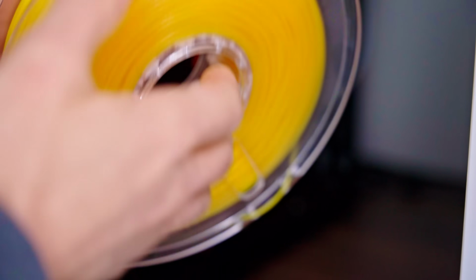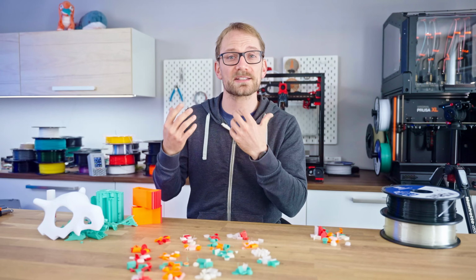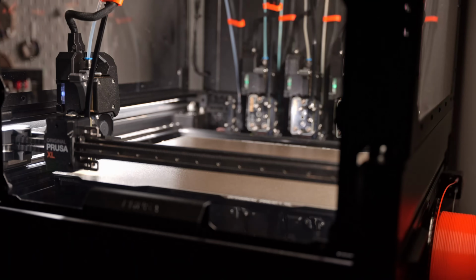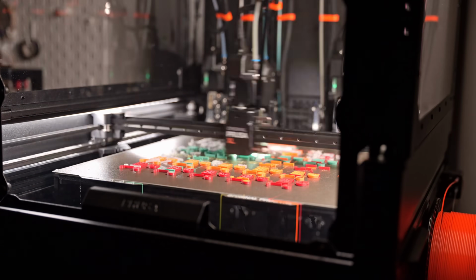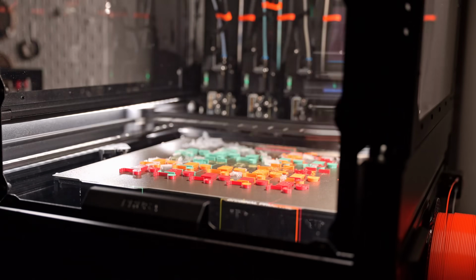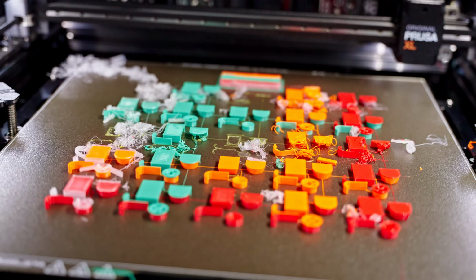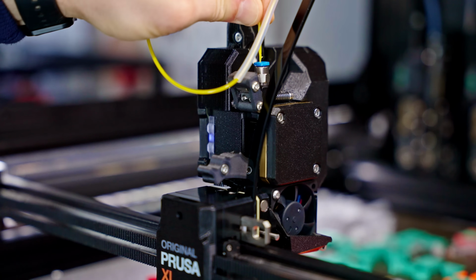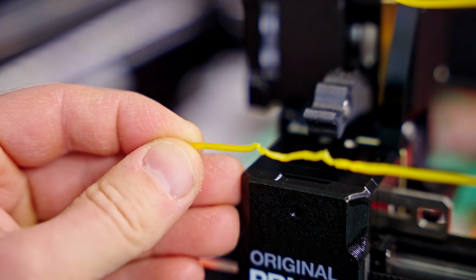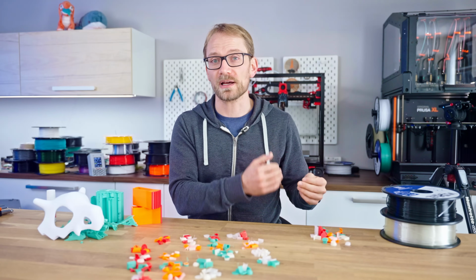Flexible materials have a lot more variance in what exact material they are, so I expected there to be an interesting difference in how well they would bond to other materials, too. But the problem is that the Polyflex filament itself has a much grippier surface than the Fiberflex, and it immediately jammed in the XL's extruder. I do like the grippy properties of Polyflex, but it would need some more tuning and probably very slow print speeds to get parts out reliably.